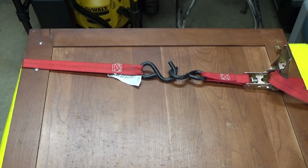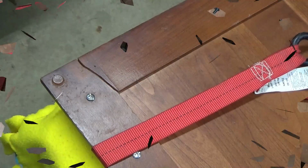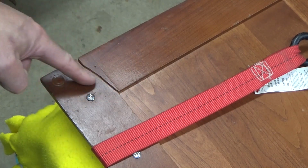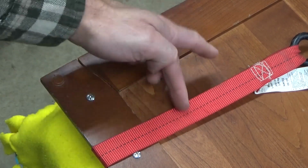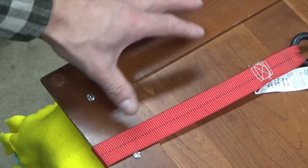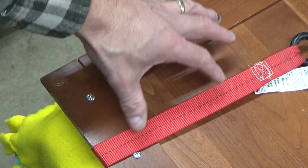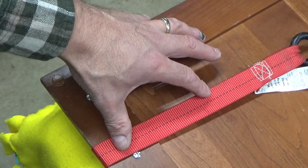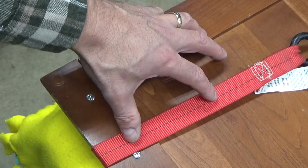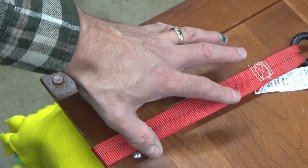All right, at this point, and you saw I actually started to close it up a little bit. At this point, I want to apply some glue. Alright, just a couple things worth mentioning here before we apply the glue. If this were an angled joint running right to the corner here, I would have a strap running in each direction, okay? And if you're assembling a door that maybe came apart, you might want to use a couple of straps in each direction. And also you want to make sure that you allow your center panel to float. Oftentimes, if you've ever pulled a door apart like this, you'll notice that the center panel is not actually attached. It's a floating panel. And the reason for that is it's allowed to compensate for varying humidity and temperature because the wood will actually expand and contract, okay?